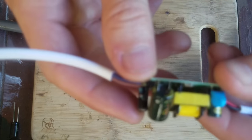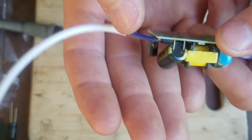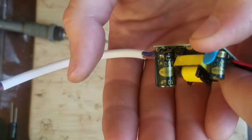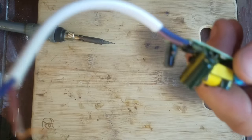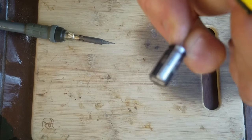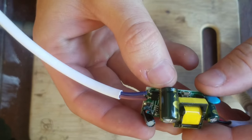The first thing you're going to want to do is note these two pads here for the capacitor. Take note — you can see the 400 volt, 10 microfarad. There's a strip on here that says minus — that's the negative side. And on the new one, you'll have a strip also, so make sure you remember that. The strip goes so you can put the capacitor in the correct direction. This one's away from the transformer, so we'll just remember that.